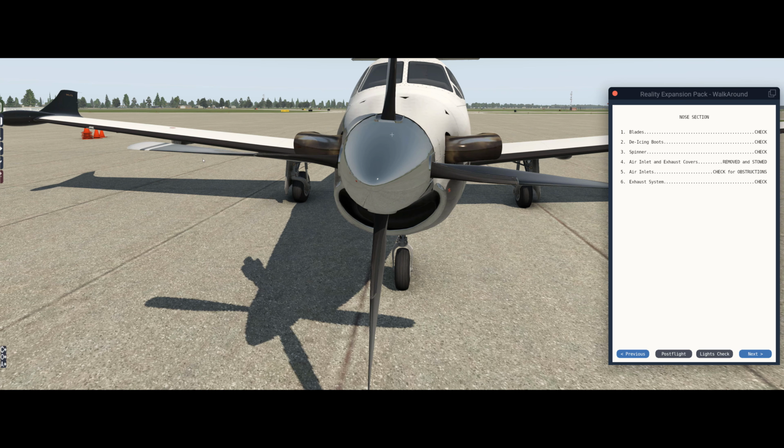So anyway, checking the boots, and then I would check the entire leading edge for nicks or damage. Anything that you can kind of get your fingernail caught in to where it's not easy to get it out is really too big to fly. And then I would also check the trailing edge for any nicks. Normally the damage is on the leading edge.